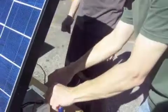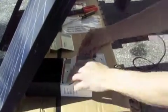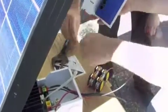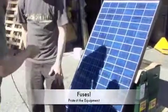Okay. Alright, next. Now we can put the cover back on. Do we need... Oh, because we'll have another... That's right. Okay. From the solar panel. That's right. Let me grab you a Phillips. Oh, before you do that, actually, it needs to clip into this wire. I'm throwing screws everywhere. This is the positive from the array, and it's going to go through the other fuse. Okay. The positive from the array.